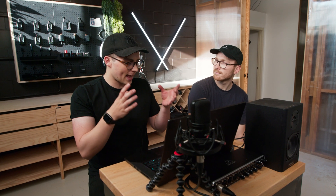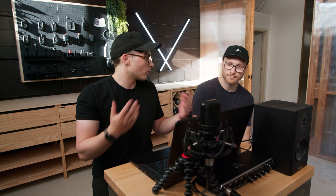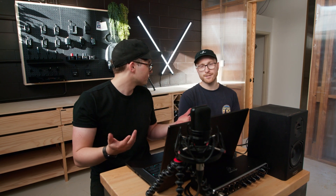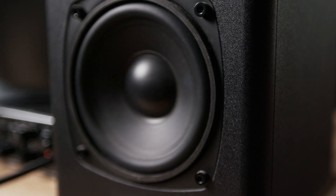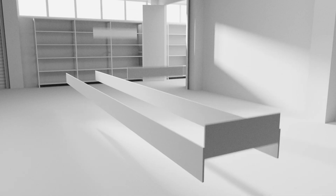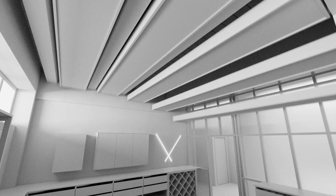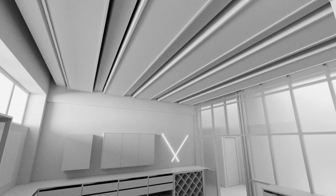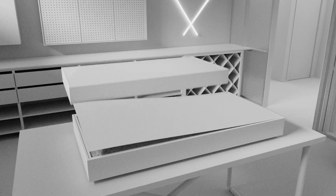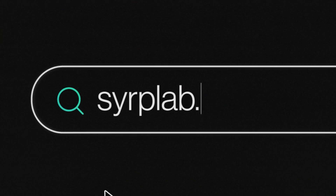We're not doing this in an accurate scientific way, but it is useful to get a visual representation of what we're doing to the space. Yeah, it's just a good idea to see if we're heading in the right direction or not. So it looks like we have our work cut out for us. We'll be building some 4.5 by 0.6 meter panels that will fit into the ceiling cavities to reduce reflections from the roof, and making some smaller portable sound panels that will absorb and hopefully scatter some of the sound. You can find our plans at syruplab.com/education or click the link in the description.